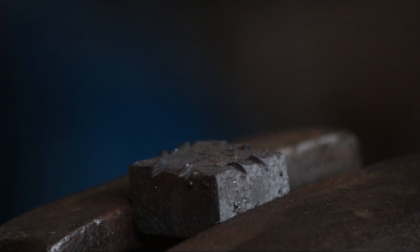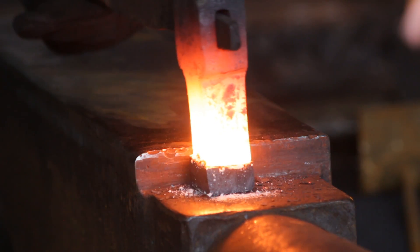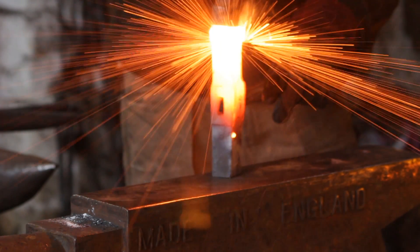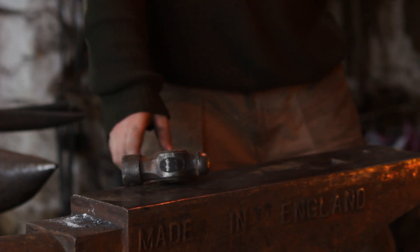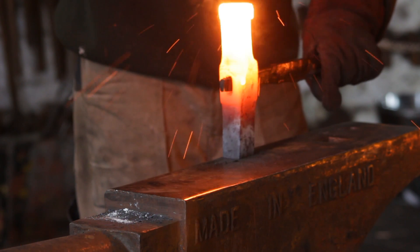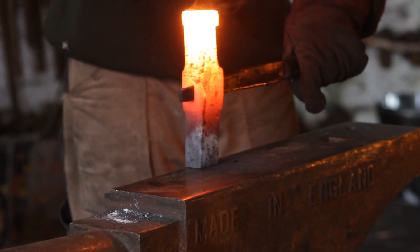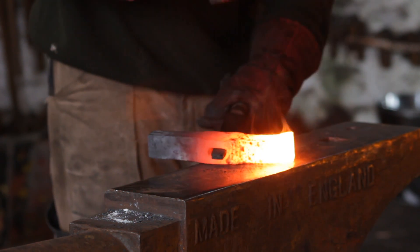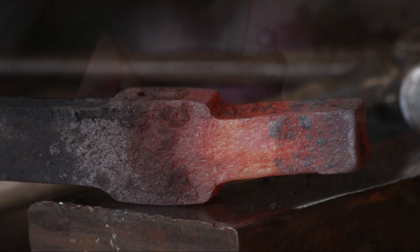These teeth are quite sharp as you can see. All I need to do at this stage is drop a bit of flux on there and tap the body of the axe hammer down onto it — and as if by magic it grips. Get a welding heat and start welding the face onto the hammer. I'm using the drift to hold it — that is to stop the eye itself from collapsing and because it's a lot easier than messing around with tongs. I tacked it with the first heat and then welded it properly with the second heat and then blended it in. And here is the end result with the face welded onto the axe hammer.